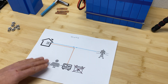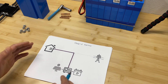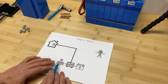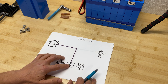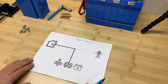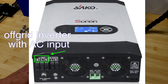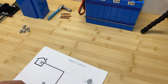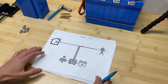The second system is off-grid. In a traditional off-grid system there is no connection to grid power at all — only solar panels, an off-grid inverter, and batteries. The inverter is connected to the house electrical panel and feeds the house. Some off-grid inverters have an input for AC power, which gives us two options for modifying the off-grid system.